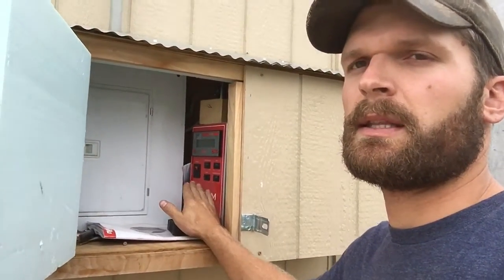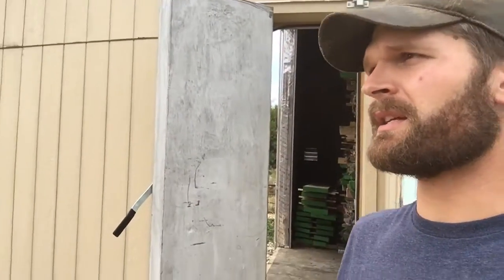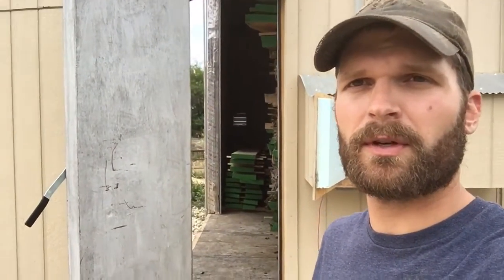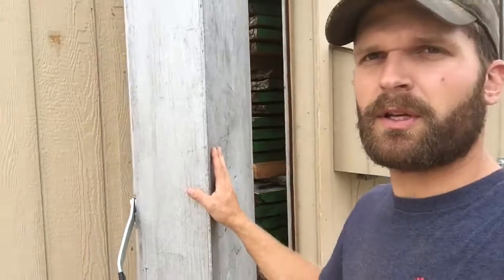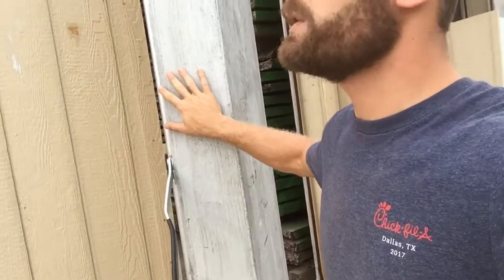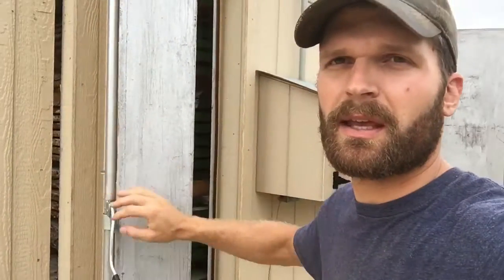They basically send this controller and then the fans and the wet dry bulb and all these cables all come as kind of a kit, and then we built the building and put the rest of it all together. It has the silver paint on there, which is actually a roofing paint. It's supposed to hold up to moisture really good. And the insulation we used was 2-inch foam board. These walls and doors are about 6.5 to 7 inches thick, I believe.